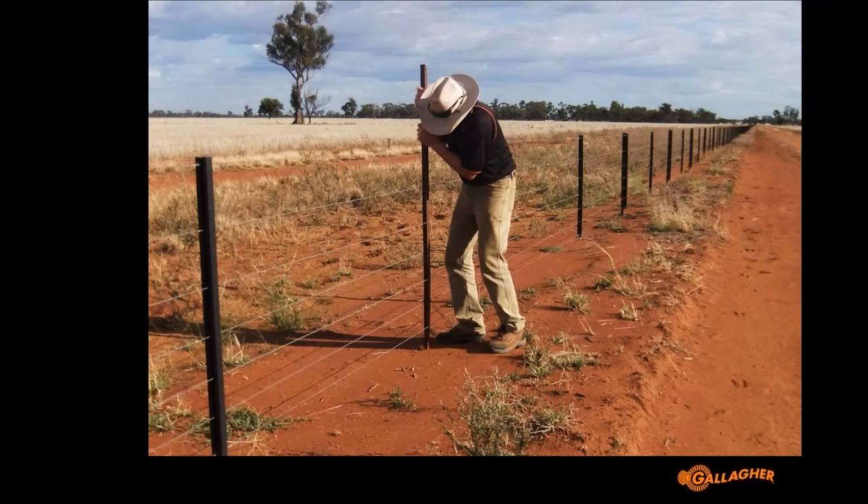One thing I've missed a bit earlier is when you're testing your earth system, to try and load up the fence so that the Energizer is running in its worst case scenario, as it would in autumn when there's a lot of wet grass just falling on the fence.